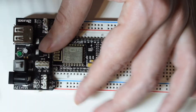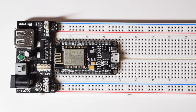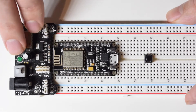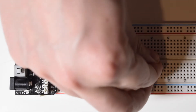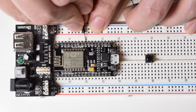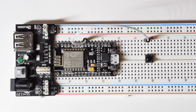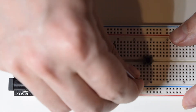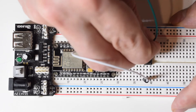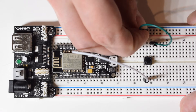What I'm going to do is to change this plastic sleeve to 5 volts, so you're going to have 5 volts here and 3.3 in here. And what we're going to do is to first create our button circuit, the one that we did yesterday. For that, that's going to be quite simple. So I'm just going to pick pin D5, which is this one. I'm going to connect it to one end of the button. And then the other end is going to go to our ground here.